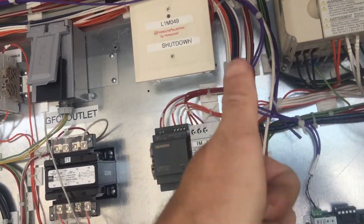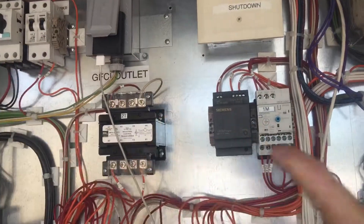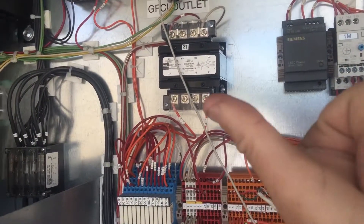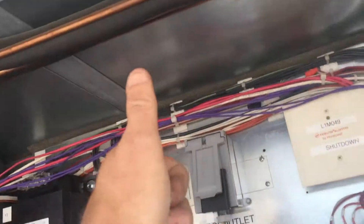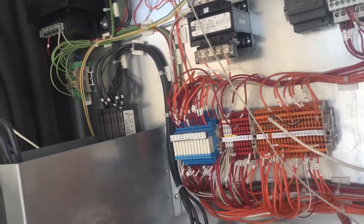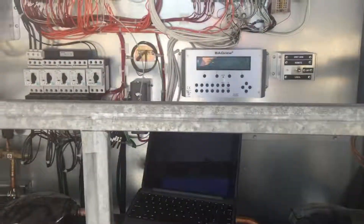We're trying to keep the head pressure up because we want hot air going through the desiccant wheel — backwards through that desiccant wheel and out through the roof — and that takes the moisture out with it, drying or reactivating the wheel. Anyway, that's it in a nutshell, guys. Hope that helps.